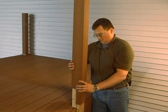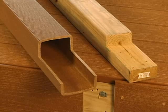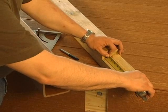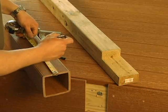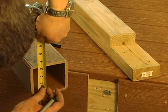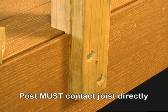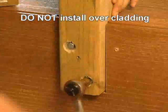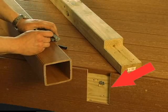The first step is to prepare the post to receive the sleeves. You'll need to cut a notch in the sleeve to match the U-top-head post. Measure the notch on the post and mark the area on the sleeve that needs to be trimmed off, matching the profile of the U-top-head post. Repeat this process for all posts on the deck. It's important that the U-top-head post makes direct contact with the rim joist — do NOT install the U-top-head post over cladding. If necessary, cut a notch in the cladding for the post. Now we're ready to install the post sleeves.